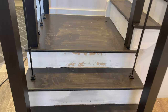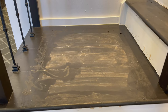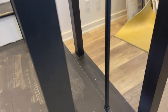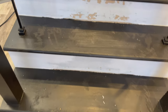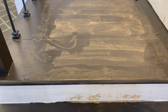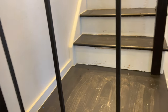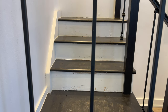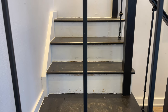This is the staircase we're doing today. We've got two stairs going up and then a right turn landing. The stairs over here are thinner than the stairs at the bottom. At the bottom we've got 30 inch, and for the top two, we've got a matching 30 inch landing. But when it turns, we're going to go to 24 inch up two stairs, then use that top stair as the riser piece. We'll show you how to cut that and finish off your staircase.